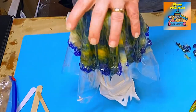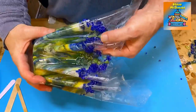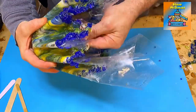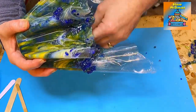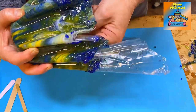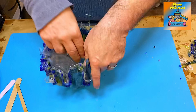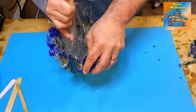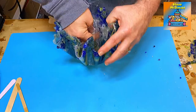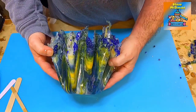This is the bowl and it comes off the silicone jug fairly easily — it's come out quite pretty. Now we just have to remove the plastic, which you can use over and over again. I usually give it a clean first, and then give it a quick spray of mold release. It just pulls out like so — there, that's the bowl finished.